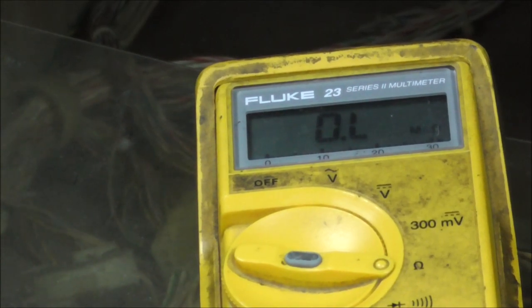Okay, folks, so we are testing the end of stroke switch on the flipper. I looked in the schematics, and the fuse for the right flipper only powers the right flipper. There is power that runs to the fuse that runs to all the other fuses, so anything behind that fuse can't possibly be screwed up, or you'd have other fuses blowing. And then the flipper, after it gets past this, connects to the return for the flipper on the bottom of the cabinet. And that flipper fuse is not blowing. So it pretty much has to be something right on the flipper.